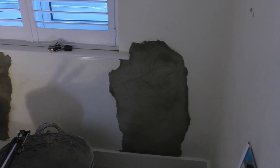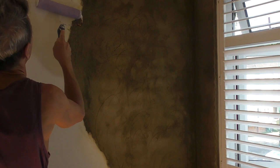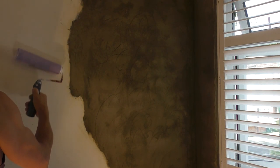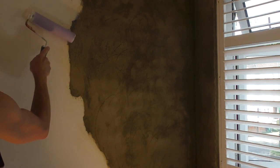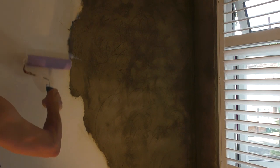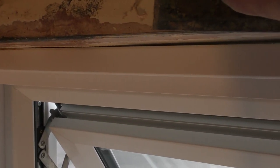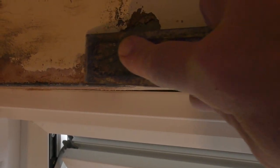Okay we're back for another day. Now because there's a lot of waterproof in that sand and cement, there's absolutely no need to put anything on top of it. All I'm PVA-ing here is the original plaster - I'm going to be putting my finish over it. I'm just literally going up to the edges - that's it as far as PVA goes. Don't put the PVA onto the sand and cement. There's where I've used the chisel just to scrape back the plaster from that top bead.